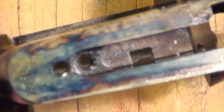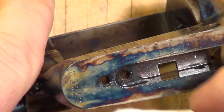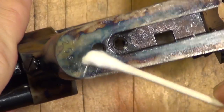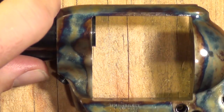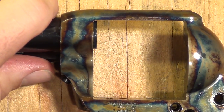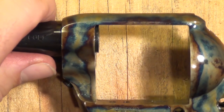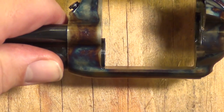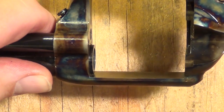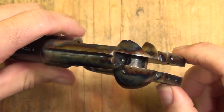There's no type of stamp on the inside on USFA's — never did — to say what year they were made. You just had to go by the serial number ranges. This serial number range falls toward the end of production, and this was ordered in 2010. You also will see a more square window for the cylinder in the frame than on Uberti. It is a larger frame window than Colt because they used Uberti-sized cylinders, so the barrel didn't cut into the frame at all. Of course, no hole for the plunger because it didn't have a plunger — it uses the traditional flat hand spring.